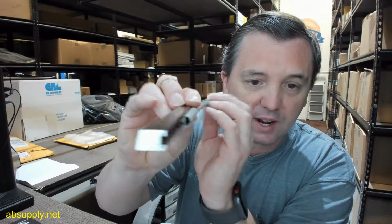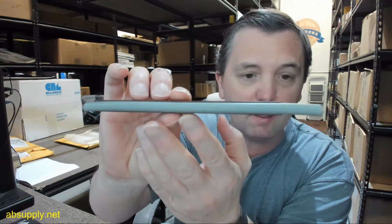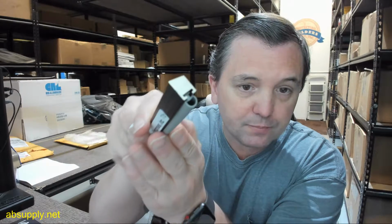This is listed in the site in lots of different lengths, everything really from 2 foot to 8 foot. If you have need for a custom length, by all means let us know by ordering the next longest piece or pieces, and simply indicate in the comment field what length you'd like for us to cut the material back to. Now the reasoning is, if this was the genuine article and you had to cut it down, that first hole is going to be generally about 3 or 4 inches from the end. So if you had to take a 4-foot piece and cut it down to 42 inches, you'll eliminate a hole. You'll have to re-drill, and countersink sometimes is really the trouble when cutting this material in the field. If you ordered a custom length, we'll not only cut it to length, you can see how clean the cut is from the factory there, but we will give you that first hole at the proper distance from the edge and the proper center to center as well.